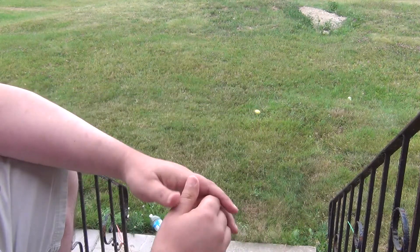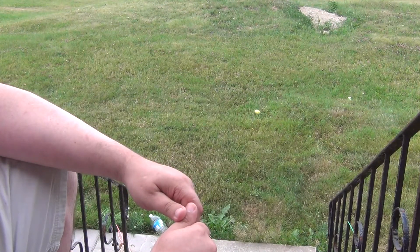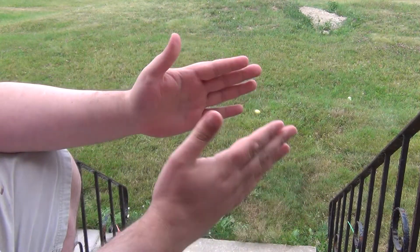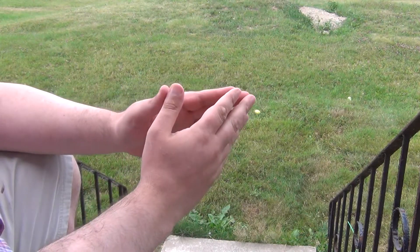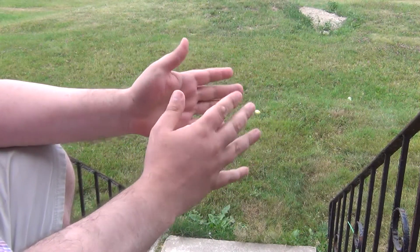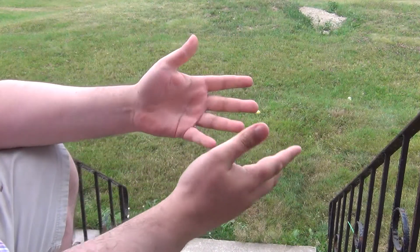With cardboard, I was having to do a very high volume of cuts — hundreds of slices — in order to wear the blade down. So that edge was bending back and forth, back and forth. I was also using a relatively weak steel, which would naturally want to bend back and forth more under those loads.